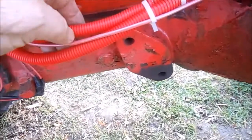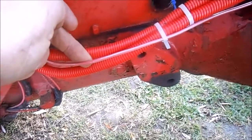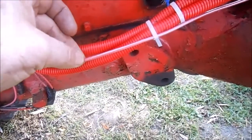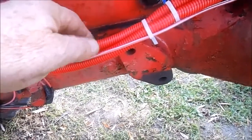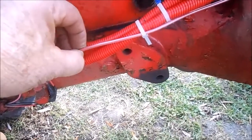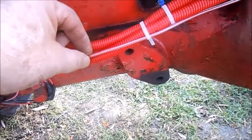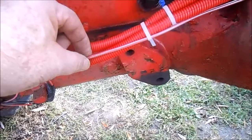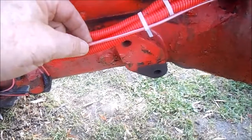We have two looms — you can see two looms here. The one wire that is not in the loom is the wire going to the starter motor, which is the battery connection. If I have problems with anything that's the wire I'm going to have to disconnect quickly, so I decided to keep that outside the loom. Also, if I ever have to change the starter motor, I don't have to go digging through the loom for the right wire.